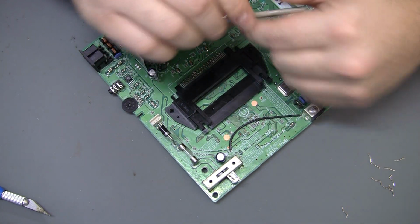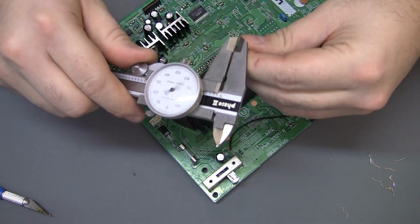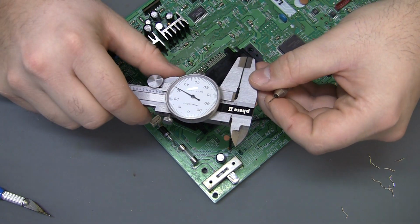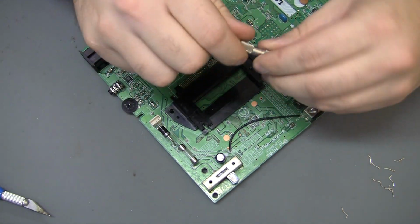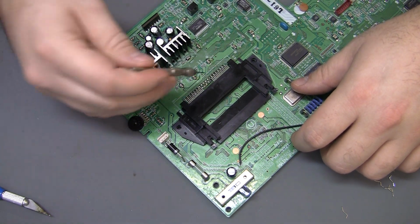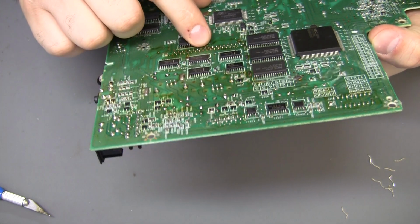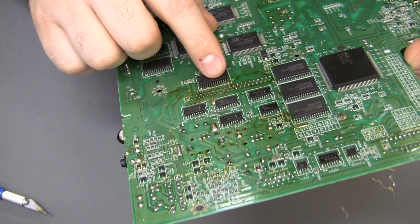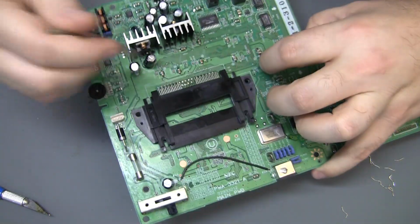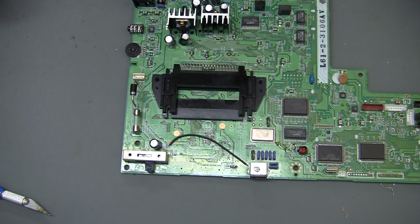I couldn't exactly tell you what size this one is, but I happen to know it's just about the right size for clearing out such holes. So it's somewhere in the vicinity of 30 or 31 thousandths. That sounds about right. And you could probably go smaller. This works really well if the solder sucker doesn't get everything out. Just zip this through and finish it off. And if it's overflowing with solder, like these are, it's not quite my first choice. Trying to drill a hole through a dome is not as easy as through a concave hole, like that one right there. That one's concave, that would be easiest to drill through, but anyway, I'm gonna let this 808 heat up and then I'll suck them out of there.